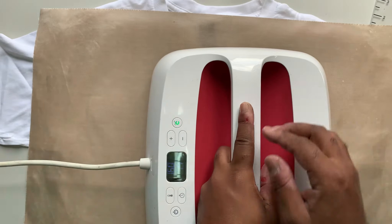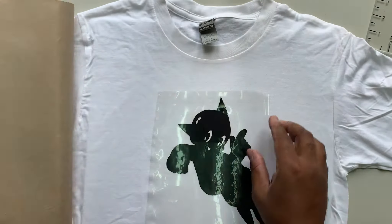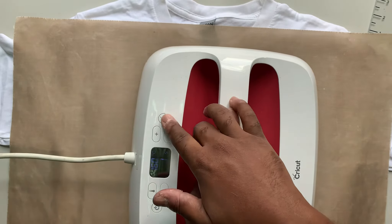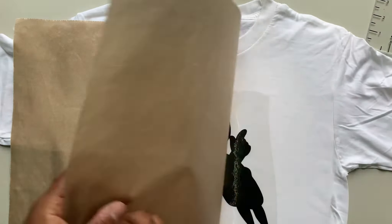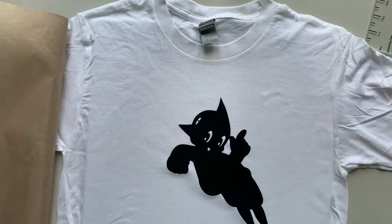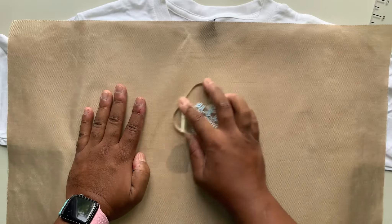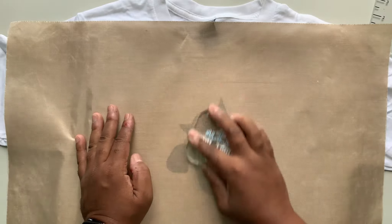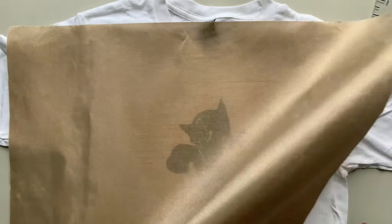We're going to go ahead and hit that on there. We started at 20 seconds and we're going to wait until it comes down to about four, pull it off — and this is a hot peel, so we hot peel that off. It didn't come up, so it needs a little more tack. We'll press again very quickly, add another couple seconds, pressing a little harder. There it goes — it's stuck that time. Now it is still very hot, so that's when we bring the Cool Touch in. We want to cool it down as quickly as possible to stop the shrinkage, because the quicker you take the heat away, the quicker the shrinkage stops.